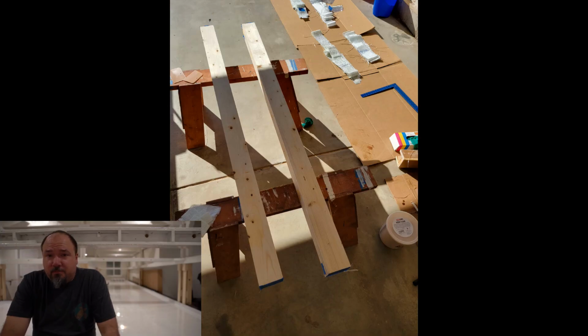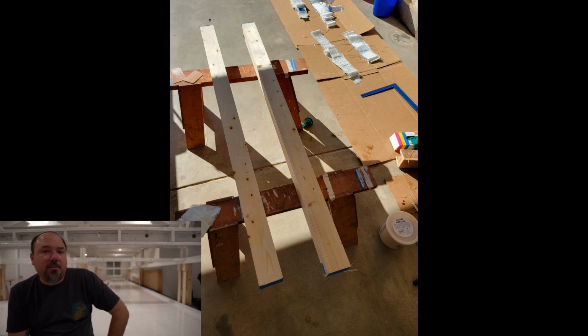I got my beams and immediately got out my blue painter's tape. I taped over all the butt joint seams that are wood to wood that I did not want resin or fiberglass on. The pocket hole jig screw holes that I needed for top brace assembly were also taped off.